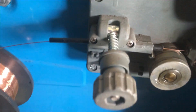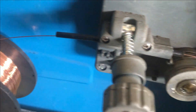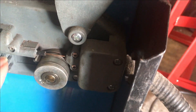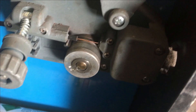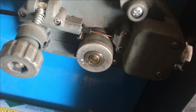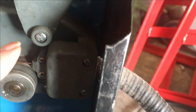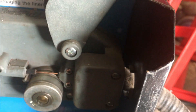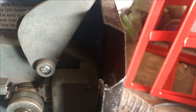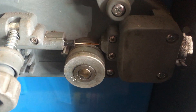I didn't record all of this, but we had a very impromptu wire feed problem. Basically, the wire started to build up in here and wasn't getting pushed out. I think that was because I had spatter on the end of the nozzle, so it built up in here. What I had to do was cut it so that it was flat with no kinks or anything, then pull it through from the nozzle, and I've now had to refeed.